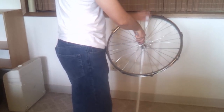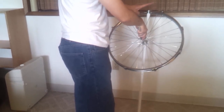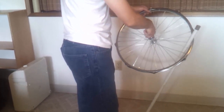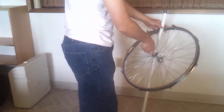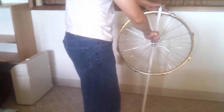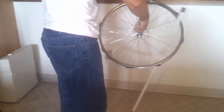When it's at the peak — at the top of the wheel that's rotating it in elliptical motion — this should be no higher than the wheel, because what you want to do is mount some type of spoke that will catch onto this shaft and support it. Otherwise, if this extends too far out, when it comes around it's obviously going to hit the shaft. So you have to consider all those factors. As it's rotating like this, what's happening from the top view is that this is actually going in an ellipse, while on the slanted plane it's going in a perfect circle.